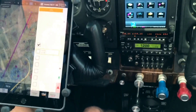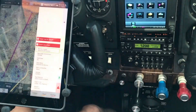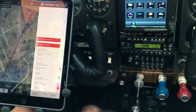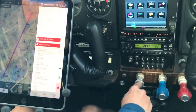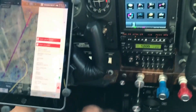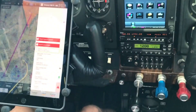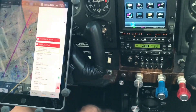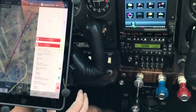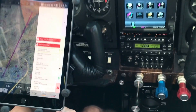Mira: power loss in flight. Power loss in flight section: maintain speed, keep aircraft control, best glide full gross 70 knots, carb heat on, note wind direction and velocity, pick landing site, select mixture full rich, fuel selector check switch on both, fuel primer locked, try reprime, magnetos check all, master on. What I showed there was that from anywhere you can attach keywords to any section in any list and immediately navigate to those, and if it's an emergency she'll even start reading that procedure directly to you.